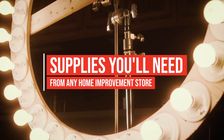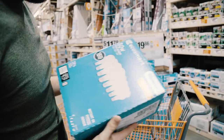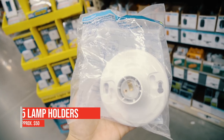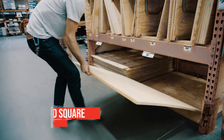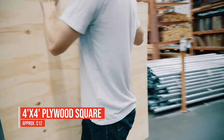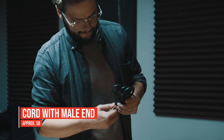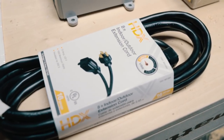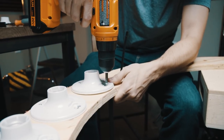To make one of these ring lights, here are the supplies you're going to need. First, a whole bunch of 60-watt tungsten household light bulbs — our light has 25 sockets so you'll need at least 25 bulbs. You'll need 25 lamp holders or lamp sockets, about two dollars each. You'll need a four-by-four foot piece of plywood, 30 to 35 feet of lamp cord, a power source such as a power tool cord replacement kit or an old extension cord, and some three-quarter inch screws.